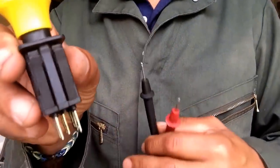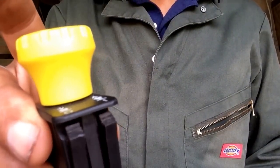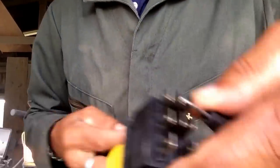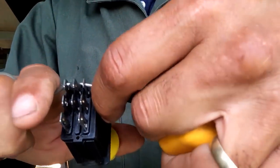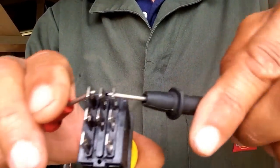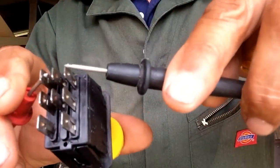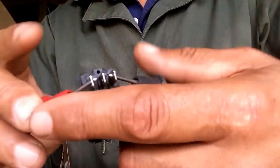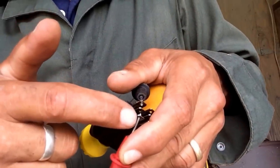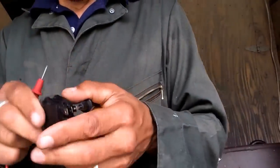This is a normally closed circuit. What that basically means is when it's depressed in — when it's off, when the blades aren't going — the two pins here should be going beep. Not the bottom two; they go beep anyway if there's a circuit. When you pull the switch for the blades to turn, it should stop. Push it back in — no noise, and the terminals are not touching. So that's a faulty unit.